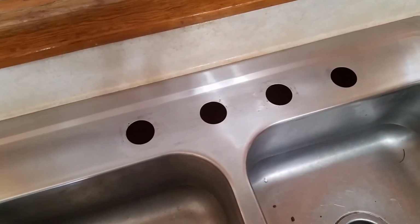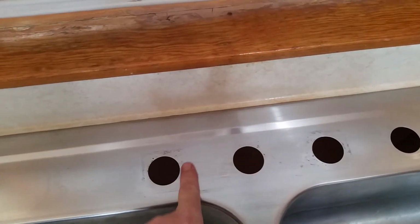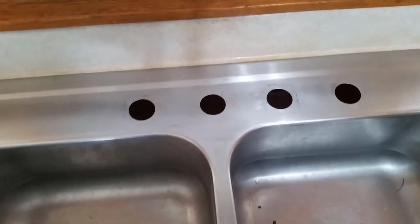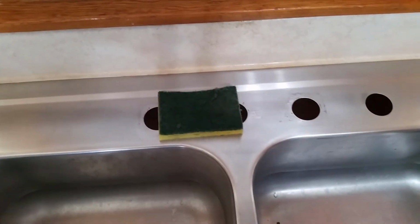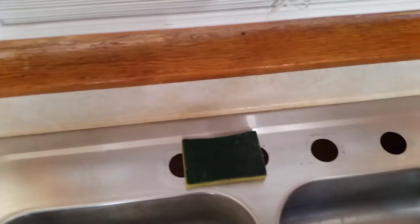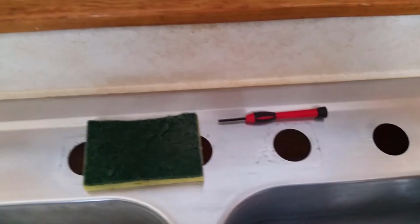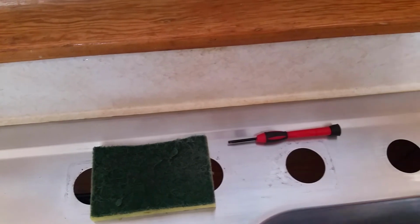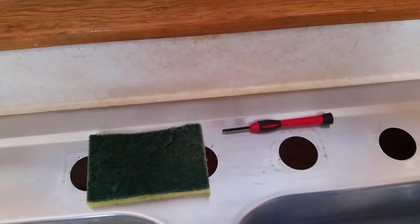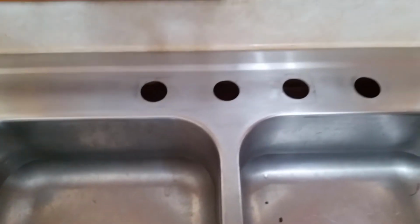All right, I wanted you to see this so that you knew that I actually did scrub it down. And you can see some of these little black spots right here. That's actually pitting that's inside the stainless. I'll give you a few tips right quick. All I used is that, and they are not sponsoring me, but good old Spray Away glass cleaner, and that little bitty screwdriver. Now if you're going to use something like that to scrape, always scrape in the direction that the stainless was polished in. Never scratch, never go across it because you'll scratch it. And the same with this. Go in the same direction. You can see they'll have lines. And just polish in the same direction that's in. So, there you go. Now on to installing it.